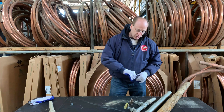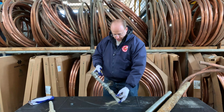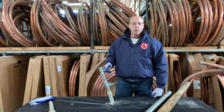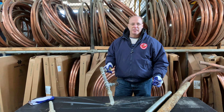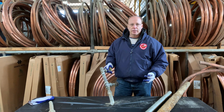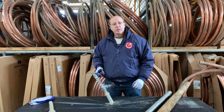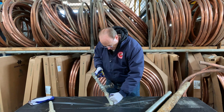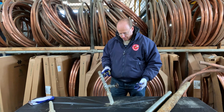The next material I can explain to you is lead — lead water service lines, which probably haven't been installed in about 70 years or so. Repairing a lead line in New York City is not legal; you are not allowed to do it. How you would know that a line is lead: it has kind of a dull silver color to it. It's also very malleable — you can take a coin, you can actually scrape lead off of this line, and then it becomes very shiny.